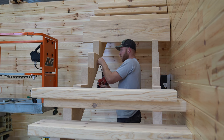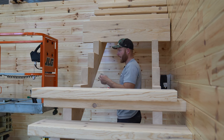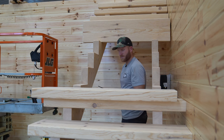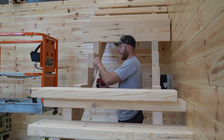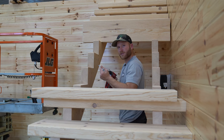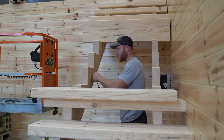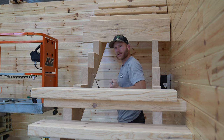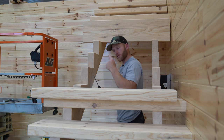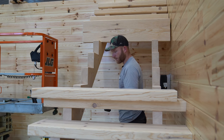One thing I've also learned is when you're doing a Kreg Jig, don't use an impact driver, use an actual drill driver, and you have a better chance of getting a good grab. I always go until I feel, as you're sucking in that screw, as soon as it gets to the bottom of this hole where it's gonna be about as far as it's gonna go, it'll make a slight draw on the motor of the drill, and then you'll see your material just suck together, and then that's it, you just let go. You don't need to overdrive it.